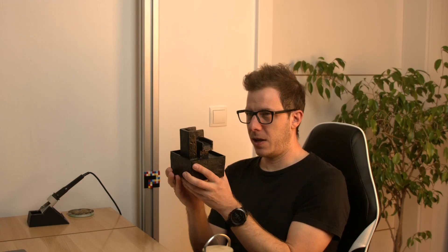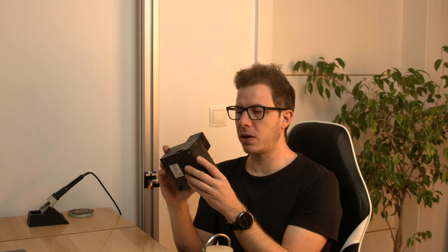So how do we make it smart? Well, there is an electric pump inside. This pump is directly connected to the battery so it runs on 3 volts. I believe that using pulse width modulation I could find a sweet spot where the fountain barely works and runs as silent as possible. I can't really manipulate the case because it needs to be waterproof, but I can play around with the battery connector. I don't want it to run on batteries anymore, so I can remove it and connect it to my electronics.